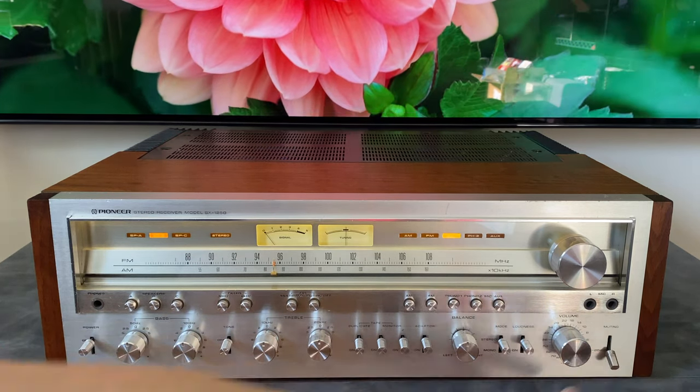For transistors, we'll go over more in a second. Let me see if I can find one with the black leg corrosion. Here's a good example. Oops, I got another tantalum stuck in with that. A lot of times these transistors will end up getting this black material on the legs, which can eventually creep up into the case of the transistor and cause it to become intermittent or noisy. So there are certain ones that are known to go bad more than others. Those ones get pulled and replaced with modern semiconductors that have equivalent properties.